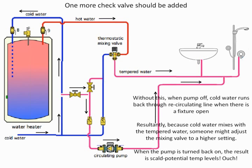So engineers, environmental people, and health people all look at how we can take care of that. One of the things we worry about is a place where a biofilm can develop on a piping system, and Legionella pneumophila can get there and you have the right temperature. It can grow to the point that when you aerate the water, it becomes a problem, and you breathe it and get Legionnaire's disease. So in some of these systems, in a healthcare facility, they will do a bypass and flush the system with 140-degree water in the middle of the night and then put the thermostatic mixing valve back online. I have seen a number of systems like that, and they set the water heater above 140 degrees.